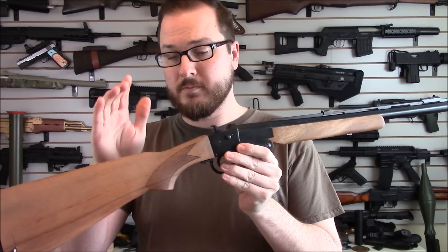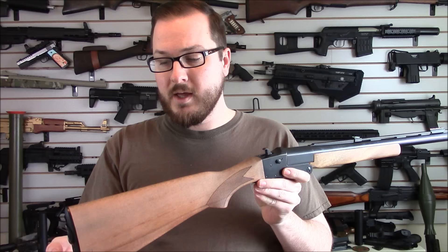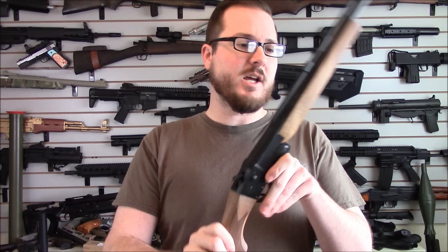Since then I finished the woodwork — a little more shaping, a little more smoothing — and then started finishing it. I stripped the old finish off with citrus strip and am replacing it with boiled linseed oil, about four or five coats in so far, doing it every single day until we get a nice strong, well-protected finish for all moisture environments I may run into.